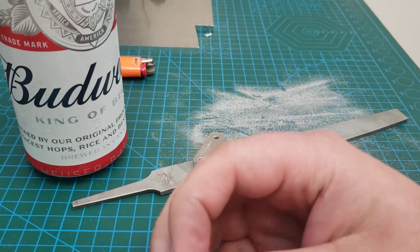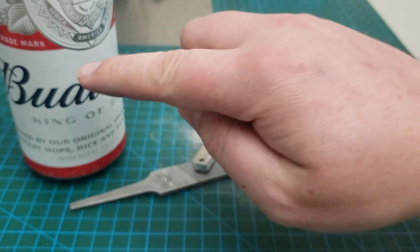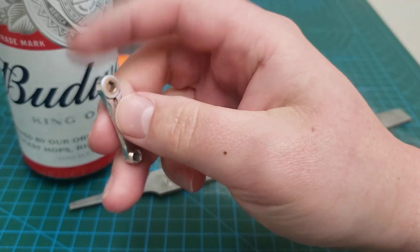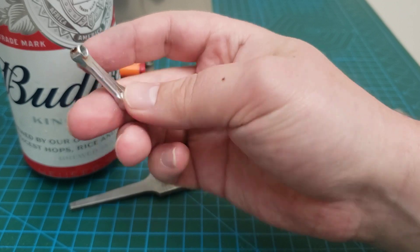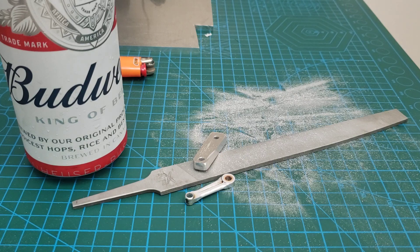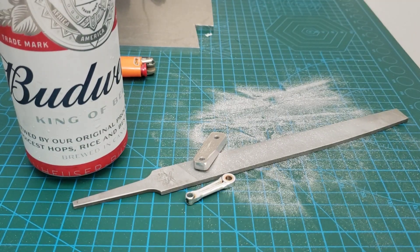Usually with the bottom end, you can tell when the bearings are starting to go bad because the crank will walk kind of eccentrically when the rear bearing starts to go out, and this will start to hammer the bottom of the case and bust the bottom of the rod. Or it'll get a bunch of slop and blow and split it down the middle. This is an old style rod so I didn't really have that problem much, but basically just to say that I did it.